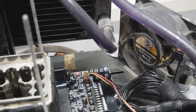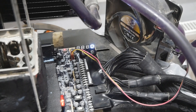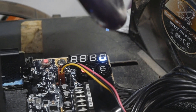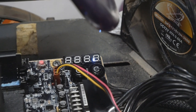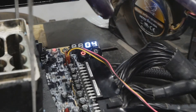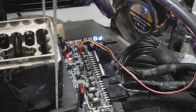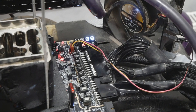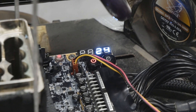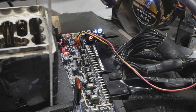If it fails, it usually gives an E1 or E4 debug code straight away. This is a good sign — it actually turned on and is now doing the whole process. If it doesn't work, it doesn't even turn on, so that's already a good indication. This process takes quite a while, so don't be confused if it keeps blinking the zero marking at the debug LED — it can take up to about five minutes. But we should be posting successfully with BIOS 1.11 successfully flashed.